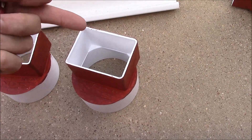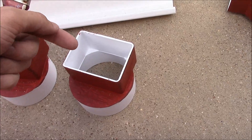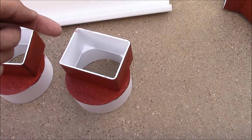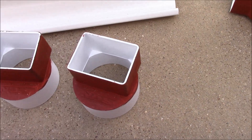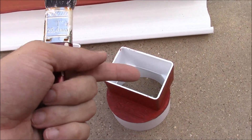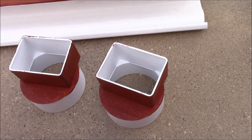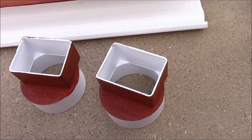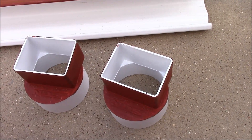It's offset a little bit to keep it away from the wall so you can get a four-inch PVC, but four-inch PVC is way too big for this, so you're going to need to convert from four inches down further. You're going to have a really hard time finding something that goes directly from a two-by-three gutter to a two-inch PVC, which would be more appropriate and is what I'm going to be using.